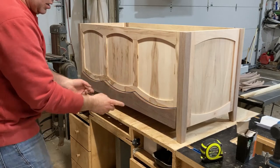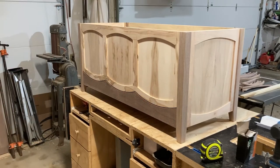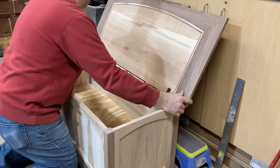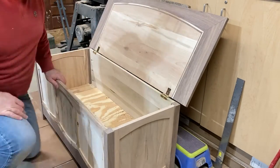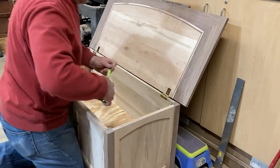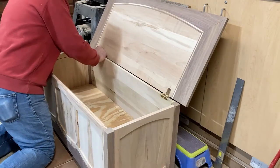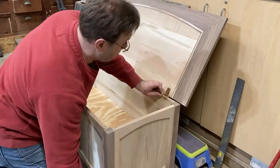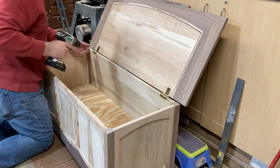Alright, that just gives it a nice finishing touch. Isn't that looking awesome? Alright, now it's time to install the lid. I'll put a link in the description for these hinges, but I'm just making sure that the lid has the same reveal on the two sides and the same amount of overhang. With that determined, I can go ahead and pre-drill for screws.